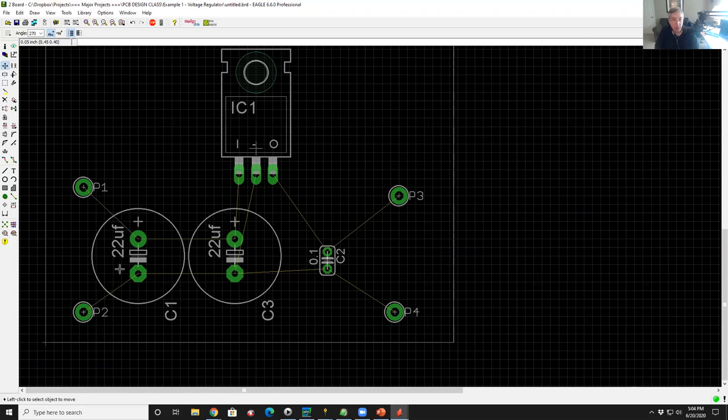What you really want to do is go in even divisions of a tenth of an inch. So typically that means 0.1 inches, 0.05, 0.025, 0.0125, 0.00625. So you keep cutting them in half. As soon as you go off that, then things don't really line up properly. The tool will let you do it, but I don't recommend it. So stick to a division of 0.1. Perfect, thanks.